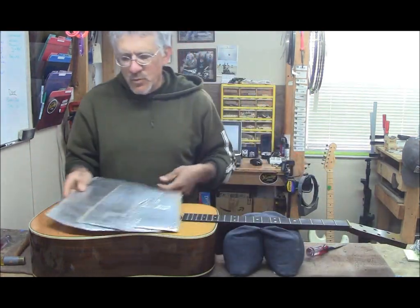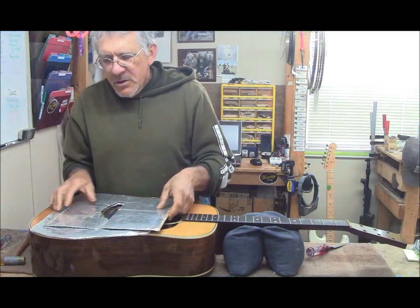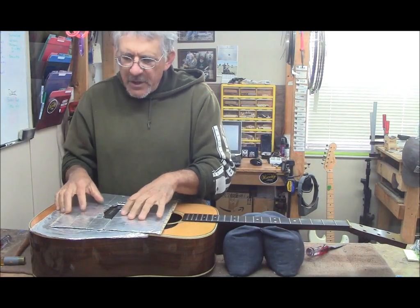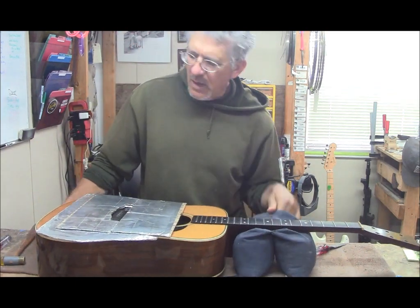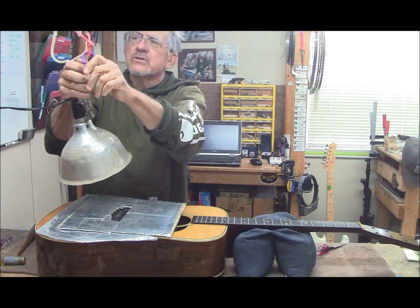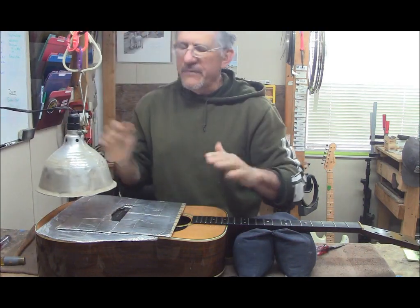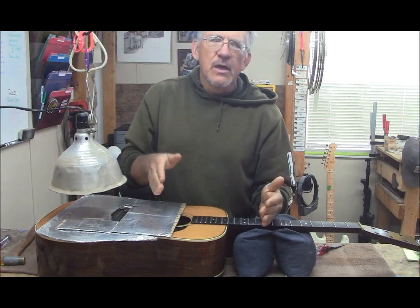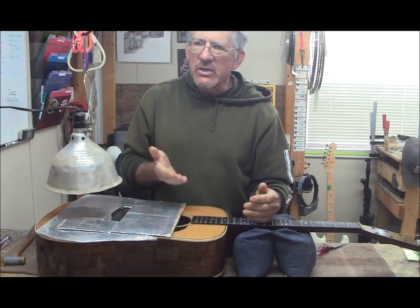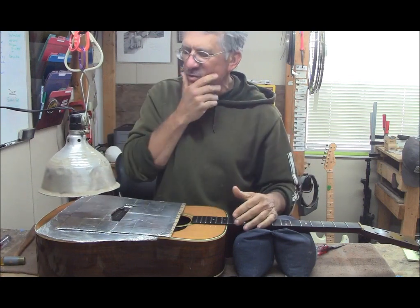That side's nice and warm, but this side's still cool. You can put a little water under there, but not yet. I don't like to get the water in there too early because it'll cause steam, which is a good thing, but the steam can go to the outer. If you do it too early, when you put water under it now and continue to heat, it'll steam too much and it can cause ripples and stuff in the finish, which I don't like.